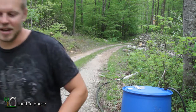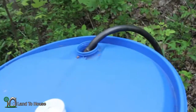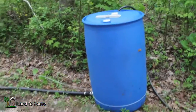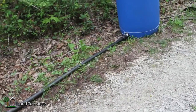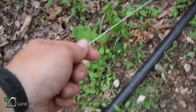Let me show you what I've got here as a setup. I've got a hose coming down from the creek filling this by gravity — it's a 55-gallon drum and it's almost to the top, just sitting here on the side of this hill. I've got the ram pump down here on a 15-foot drive pipe. I've also got a bubble level and a string attached here so that we can measure out the point at which the pump will be level, because that's going to be important.